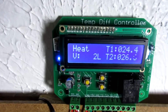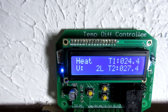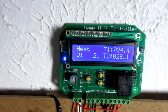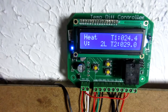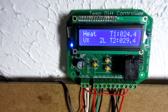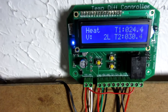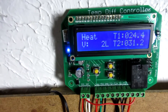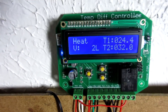As you can see, it's beginning to rise just a little bit. We've got a three-degree difference going on there — climbing. Up to 30. I forget if it was three or four degrees that was our Tdiff value set, but we're well past that. However, we haven't crossed the minimum threshold yet, so it's going to climb until we get to 35 here.